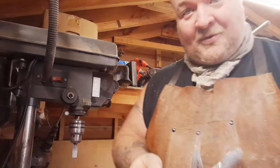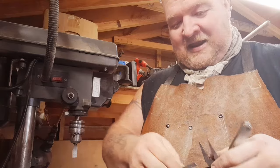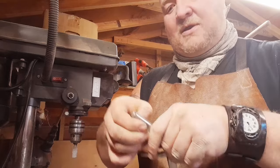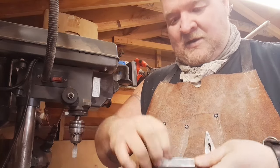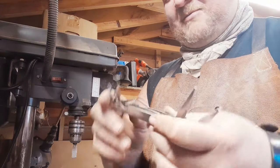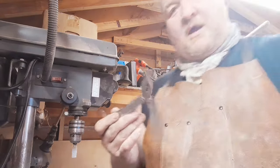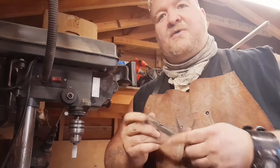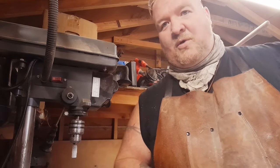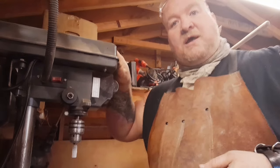All right, like I said, that wasn't going to take much. Hope y'all enjoyed the world's tiniest hammer. See, nice and tight now. They don't just flop around anymore. That's all it really took. You just take a really small hammer and tighten up those rivets a bit. A couple of taps with the world's smallest hammer, and now it's straight and goes in and out just fine. And once I've epoxied all this up, I'll make sure to oil this real good too, to make sure it works good. So let's get that other handle in the vise, get it ready to drill out.